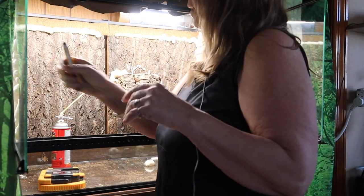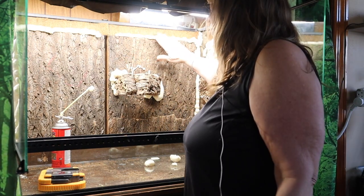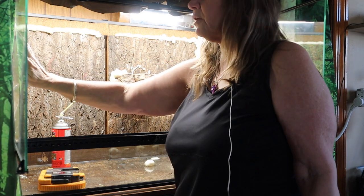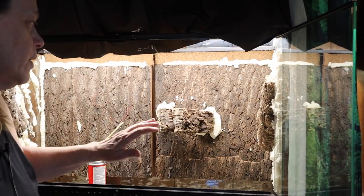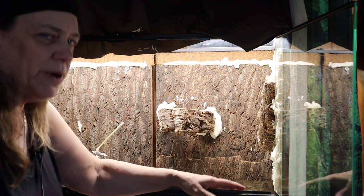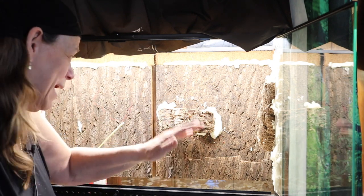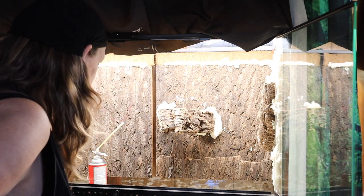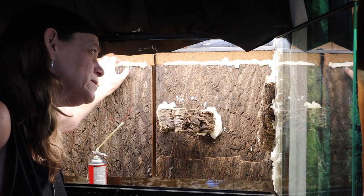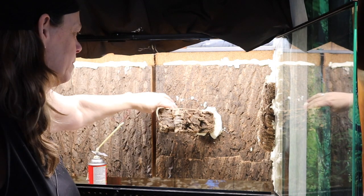This seems pretty dry and everything seems pretty stable. What I'm going to do is — since this expandable foam is so shiny and smooth — I have to cut a small layer off all of it so that the silicone will stick to it. This seemed to be the most counterproductive exercise I've ever done, putting all this stuff on and then taking almost all of it off again just to expose the inside. But I'm going to clean this up and start with the silicone.